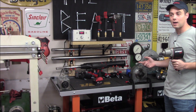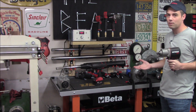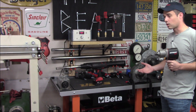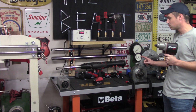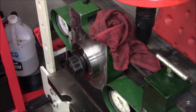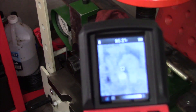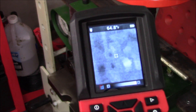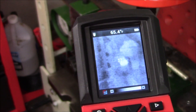Let's say you tighten this up to 1000 foot pounds — about 800 or 850 foot pounds would remove it. So if we look at our maximum forward or reverse working torque and tighten down a nut or bolt in the Skidmore using the Earthquake XT to 1100 foot pounds, the Milwaukee shouldn't have any problem removing it. Here's the Skidmore Wilhelm we're going to use to tighten it up more than the Milwaukee can achieve — we'll go all the way to 1100 foot pounds. To show the nut and bolt aren't already hot, I'll take the Milwaukee M12 thermal imager for a reading. Zooming in on that nut, it's coming in at 64.9, roughly 65 degrees.